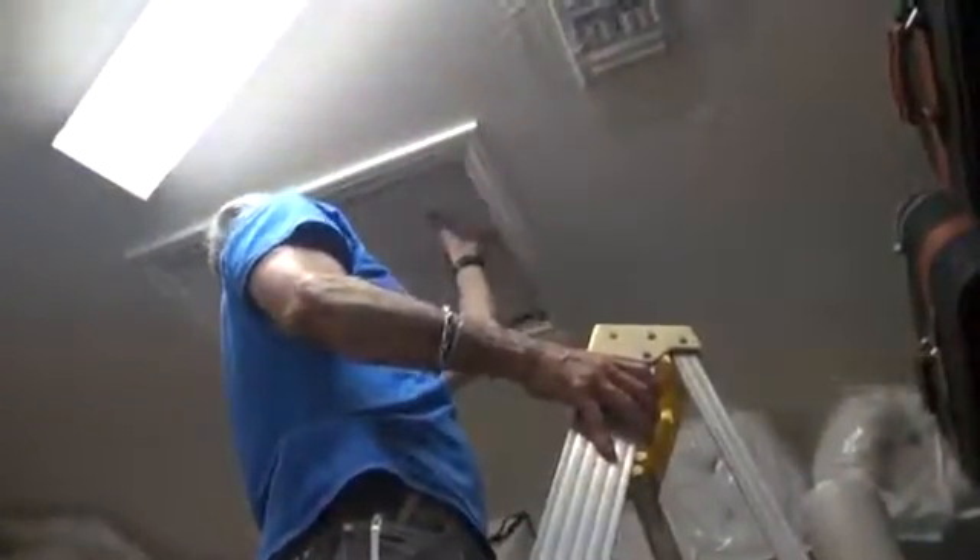After sealing all the duct openings to prevent air leakage, be sure to open all the interior doors in the house. This includes bedroom doors, bathroom doors, etc. Additionally, open one door or window to the outside. Also, turn off any bathroom or laundry area exhaust fans. Lastly, if there is an opening in the ceiling to the attic area, open that as well, especially if the furnace is in the attic. This helps balance the air pressure inside the building.